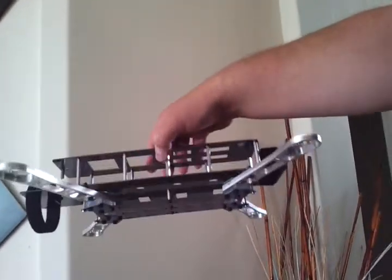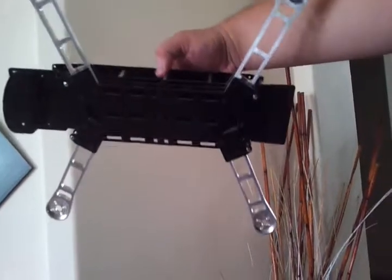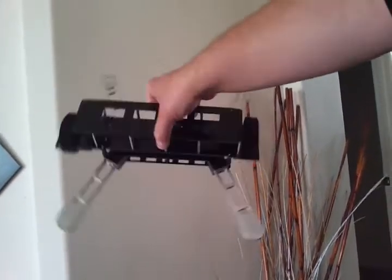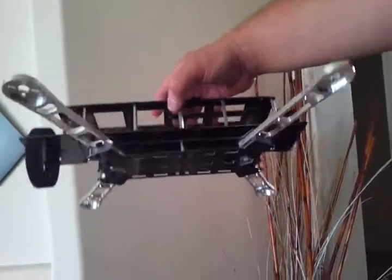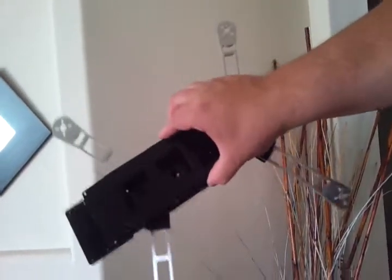It's pretty solid. It's got machined aluminum arms made out of quarter-inch 6061 — they don't twist. I also have plastic screws mounting some of the parts, so in the event when you do crash or have hard landings, you just pop a screw. You don't bend or break any of the G10 or the arms or anything like that.